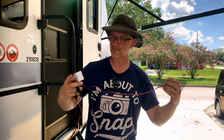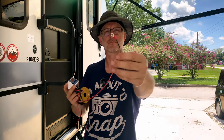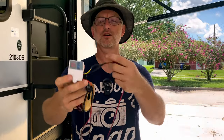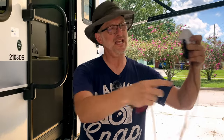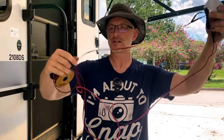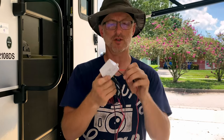I've got the thermostat — the temperature switch — hooked up. I've got my negative on a circle clamp crimp and another circle crimp. These are going to go to the USB power block and then to the fan: positive to the yellow wire and negative to the black, according to the instructions — the only place to find those is on their Amazon listing, so link is in the description below. I've got 18-gauge wire from the bus down to the fan.